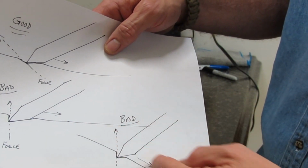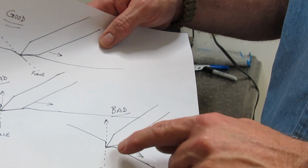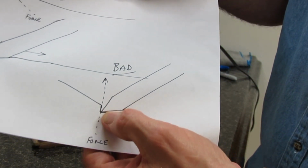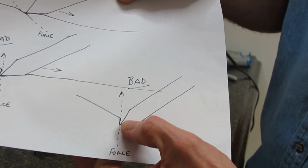See, here's the surface of our strop, and here's the angle of our knife. That's probably like 75 degrees. We don't want it that high, because even with moderate pressure, we're still digging way into the leather and causing that over 90-degree angle of the leather coming back, so we're wiping off the apex.